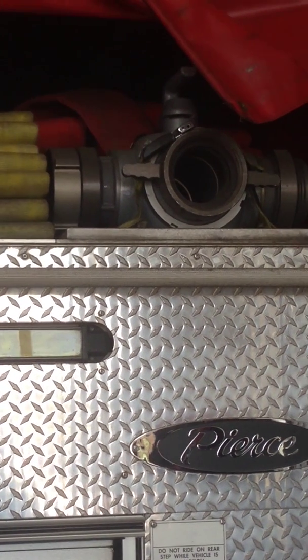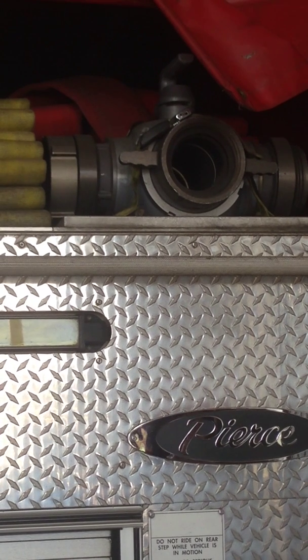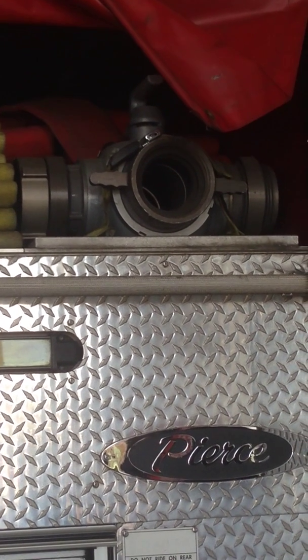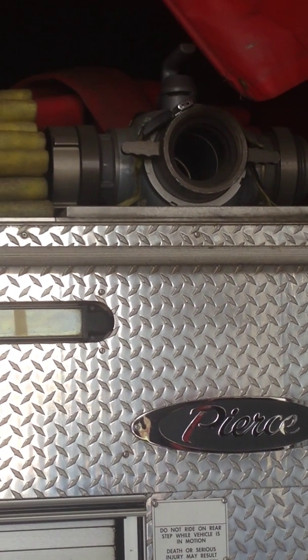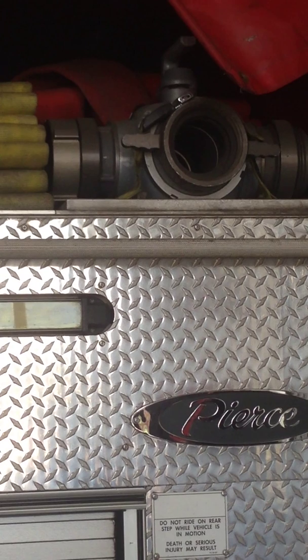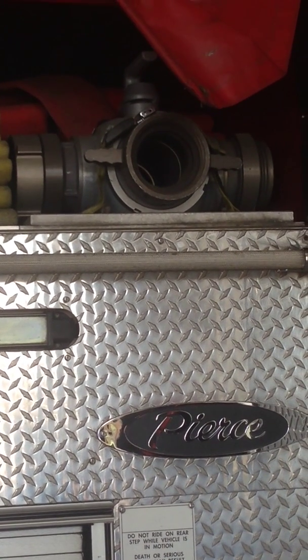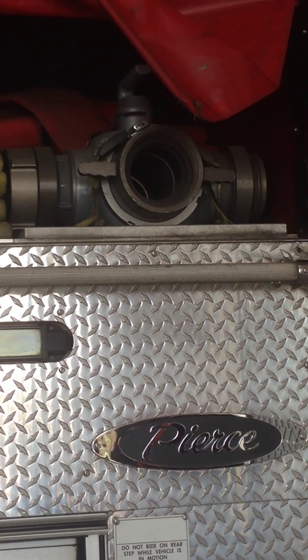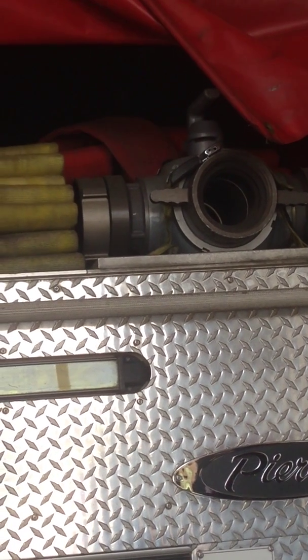To supply the initial pumper, leave the handle in line with the initial supply line. To boost pressure from an additional pumper, turn the handle to the left while standing at the hydrant. The discharge line of the additional pumper goes into the left side, while the inlet line connects to the right side. There is a clapper valve inside of the 4-way that will change the flow of water once the pumper overrides the pressure of the hydrant. To shut the hydrant off, pull out the safety lock and move the handle completely to the right.